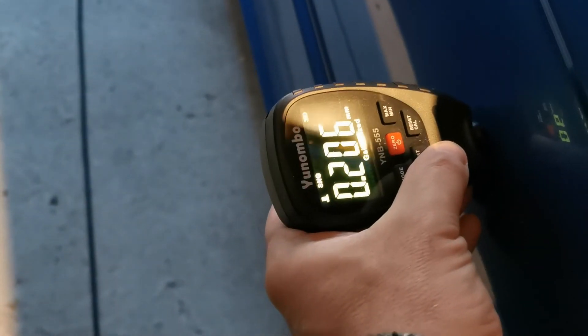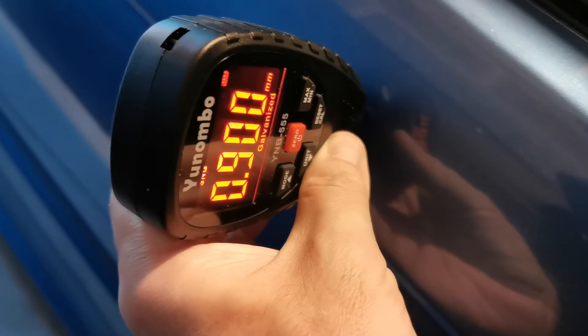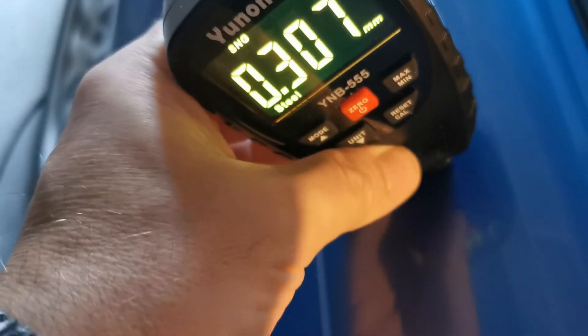This door as well - there was a paint scab on here since I took ownership of the car, which they had to paint over. I'm guessing they painted either the whole door or at least from here upwards. 0.2 - that's a repaint. This back quarter panel: 0.3 - that's been repainted. So you get the idea.